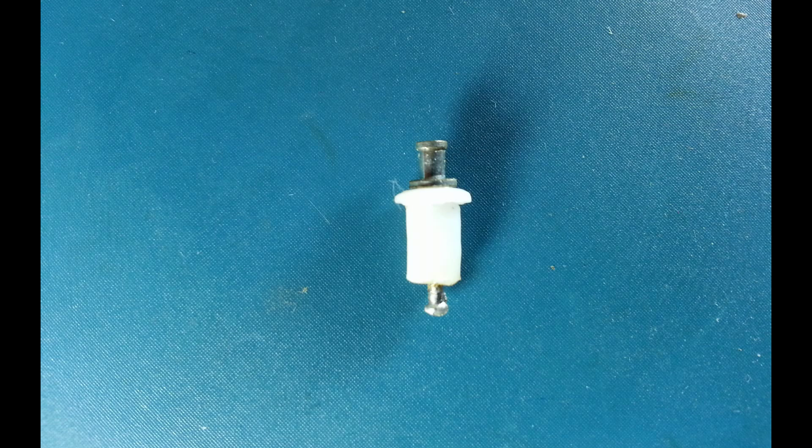There is an issue of how do you bring the connections back to the top so that you can connect to the prototype area. And I use these feed-throughs. These are feed-through connections. On the bottom is a lug for soldering. On the top is a solderless connection that will accept a 22-gauge wire or 20-gauge wire. And the sleeve is Teflon, which is a good insulator. The way this is mounted is you drill a hole and force-fit the insulated feed-through through the hole in the panel.